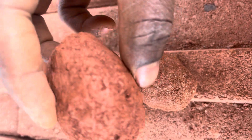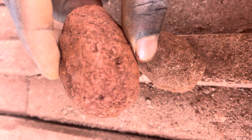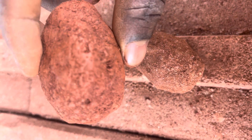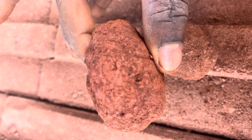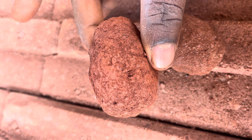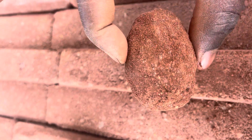This is an example of a clay soil, and this is the ideal soil for compressed stabilized earth bricks. All you have to do now is analyze the percentage of sand, silt, and clay in this clay soil, and then you can amend it in order to produce compressed earth bricks.